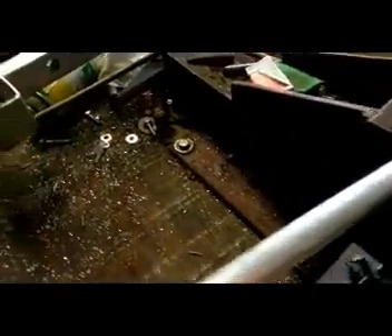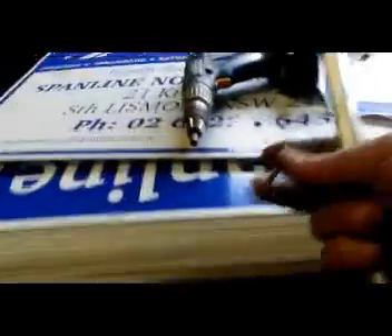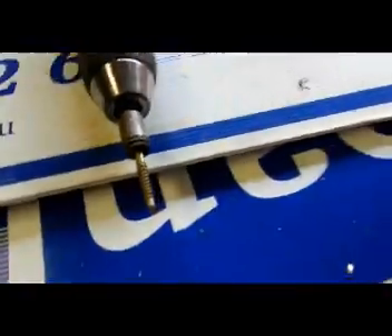Once they were drilled, I put them over to the vice and put a kink of about 5 degrees into the bar. I just put a bar on the bench and lined it up by eye — it just needs a couple of degrees bent into every rod. It doesn't matter when you tech it all up. What I used was these tech screws and a cordless drill with a driver in it. Brilliant — because you can just add struts as you go. It's a very simple system.